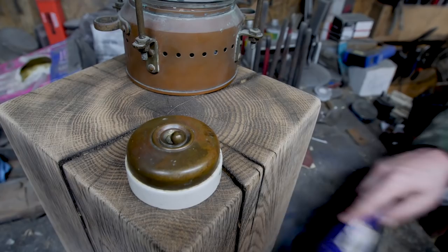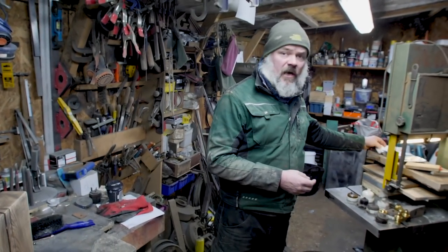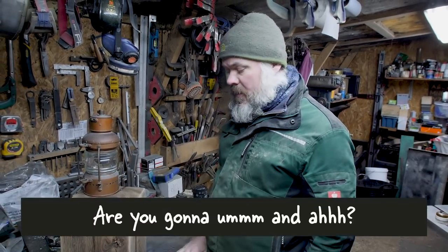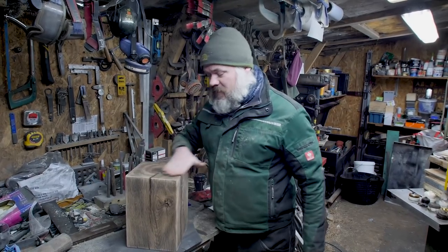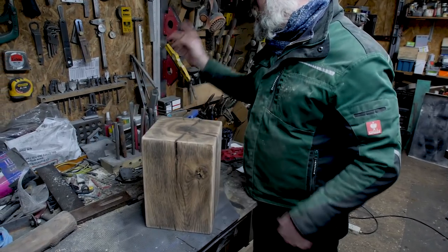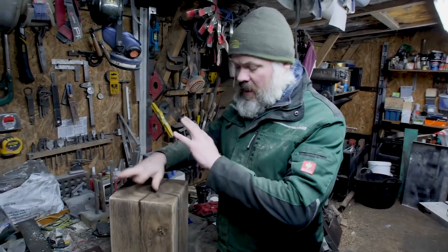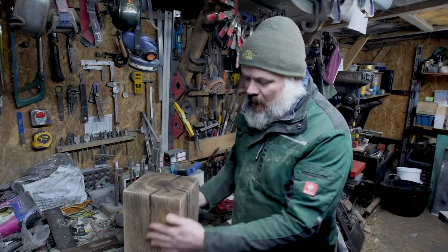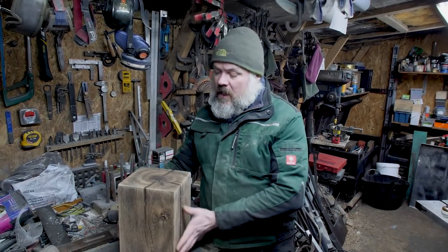It almost sounds like you don't have a definite plan. No — there are some things we've got to do and we'll jump into those, but there'll be a lot of offering things up and seeing. Taking an oak block — this is an air-dried piece of oak, just under eight inches, seven and three-quarter inches square. We've sanded it with 80 grit on a belt sander, then 80 grit on an orbital, then 100 grit, 120 grit, then flamed it, then 240 grit and just rounded everything over.